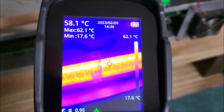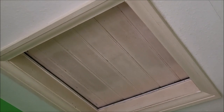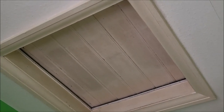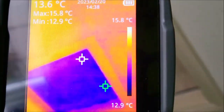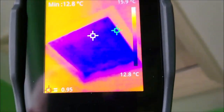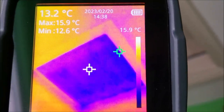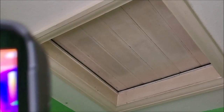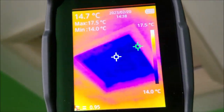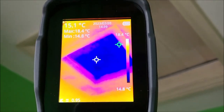The second use case is this loft hatch cover — just boards held together with cross-pieces that tend to go moldy. Looking at it through the thermal camera, you can clearly see it's about three degrees colder on the underside than the surrounding ceiling. Water condenses on the cold surface, and anything permanently wet will attract mold. It's very easy to see where and why mold appears in certain areas.